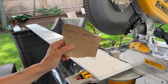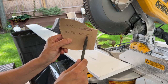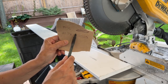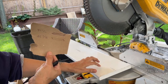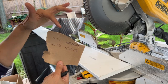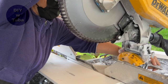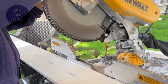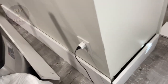Here's how I measure my moldings to be cut. First I measure them and draw a profile showing which way the 45-degree angle has to face, depending on whether it's an inside or outside corner. I tried to cut from the back side of the moldings to avoid chipping the front. This is a double-bevel miter saw — it tilts to both sides, which makes cutting so much easier. You adjust the angle by loosening the handle in the back and moving the blade to the angle you desire.